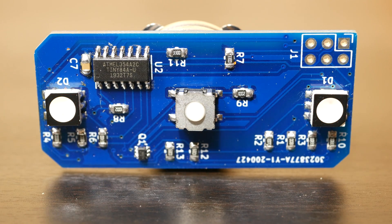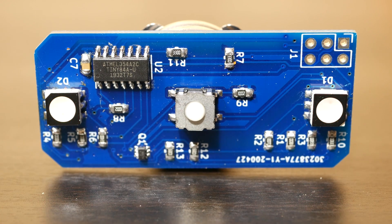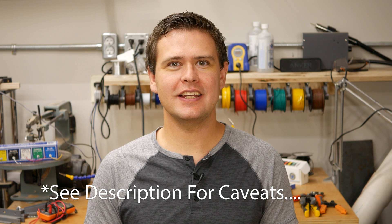Now hang on — just because you can get away with something doesn't mean you should. You might ask: why not use a 3.3V regulator instead? That would have been a pretty sane choice. But any sensible regulator here would be a step-down only, meaning as soon as the battery drops to about 3.3V the regulator can no longer function and the light is essentially dead. Both the ATtiny and the red LEDs can function well into the lower 2V range, so the light can still work beyond that point outputting only red. As Elon Musk likes to say, the best part is no part — and while I can't recommend this approach for every application, for a silly dog collar light it really does seem to work.